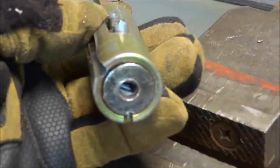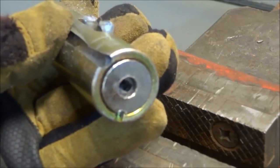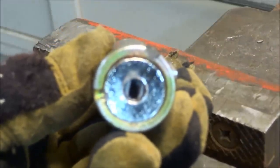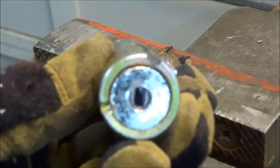I've tried everything in the quiver trying to get that core out, so now this is just going to become more of an autopsy. This may take a while — this entire sleeve is almost a quarter of an inch thick, so it's probably going to take a while to go through with a grinder.